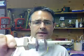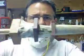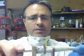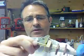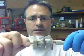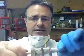Hey guys, I'm back, and it took me about 10 minutes or so, and what I ended up doing was I cut the antler, and this obviously is an old one. Again, you can see the different color. It's bleached with the sun. It's just an old antler, kind of rusty spots here and stuff. Anyway, I cut it with a bandsaw, and then I added these pieces of purple heart and this last piece down here of this antique mesquite where the reed's going to go. It's not glued together. You can see where this goes into here, and all the other pieces are cut at that size. And now I'm going to go ahead and epoxy everything together and just let it set.